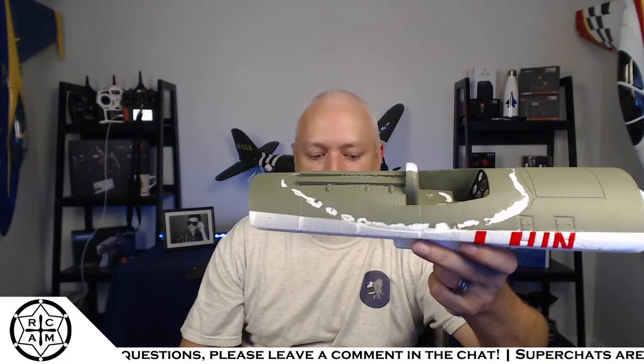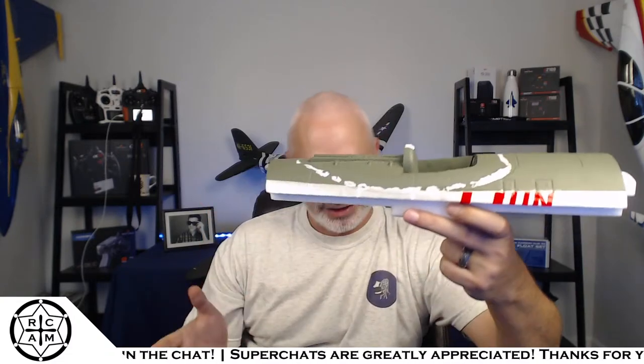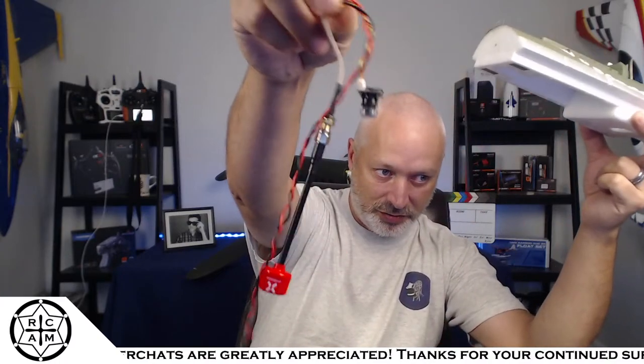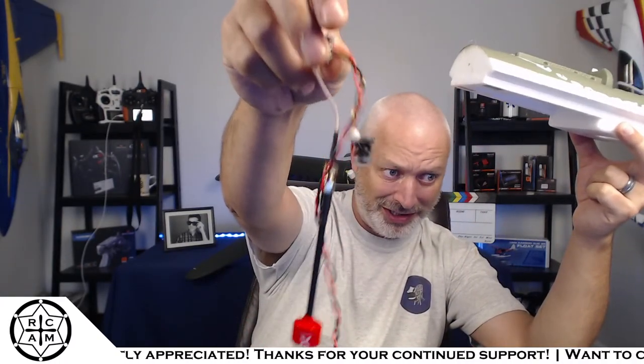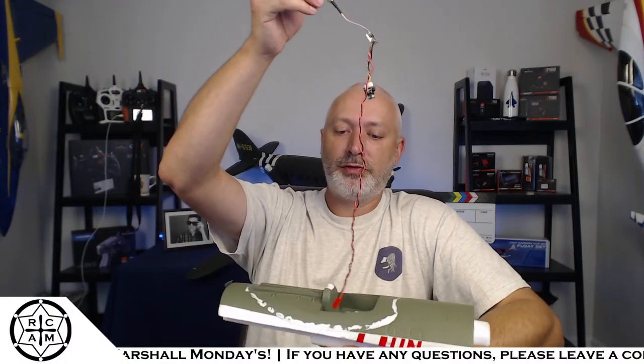But obviously, this thing is not outfitted for the FPV components, such as the video transmitter, the antenna, and the camera itself, which is all part of this little thing here. So I'm going to be cracking open Fusion 360 in a little bit, which is a very powerful 3D model design tool. We're going to create some 3D models and convert those into STL files that I can output to a 3D printer or to the slicer software so we can 3D print a mount